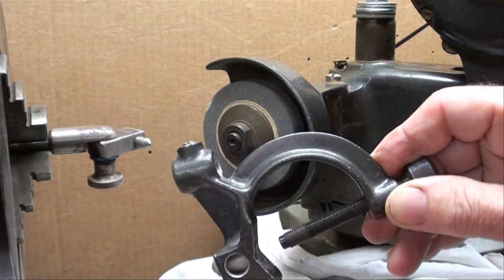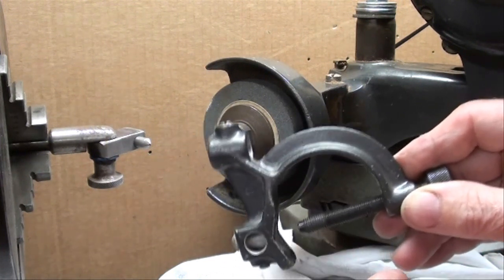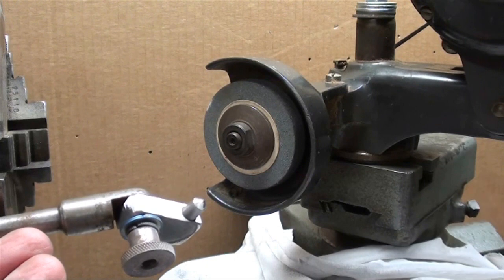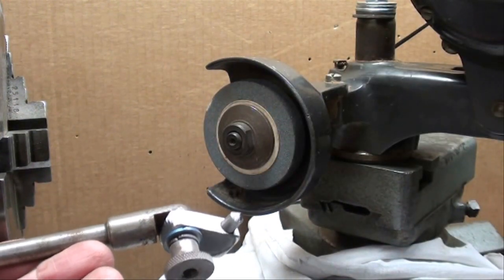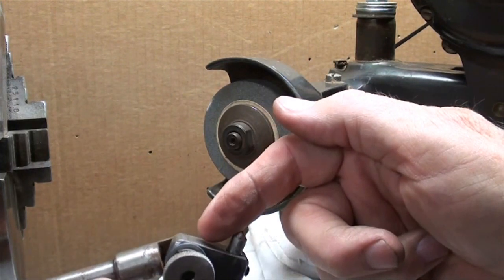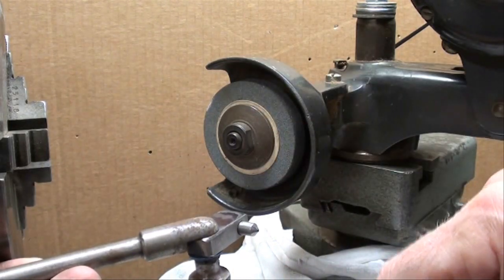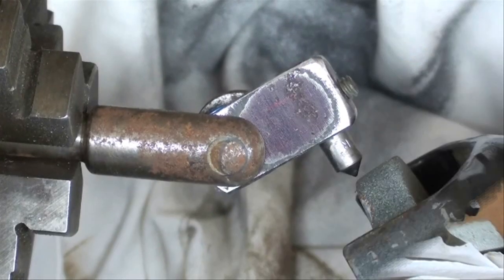The diamond can be put into different positions — normally it clamps around cylindrical work with a little V. But there's no good way to hold this in position when grinding at a 30 degree angle, so I made up a little fixture to hold the diamond. It took about 15 minutes to make. I already had a rod with a knurled nut and a small piece on the end — I think it's part of an indicator holder — from my junk box. I made a small piece with a set screw to hold the diamond nib, and you can loosen the nut to change the angle. This will be held in the three-jaw chuck so I can present the diamond to the wheel at approximately perpendicular rather than at an angle.